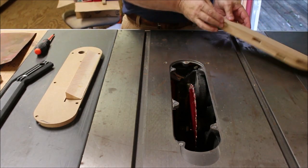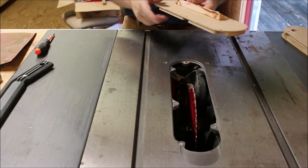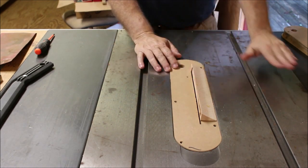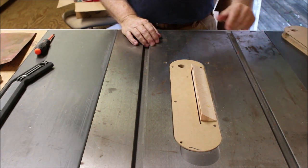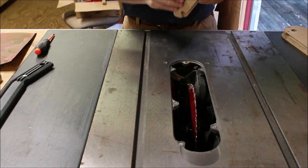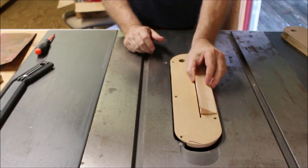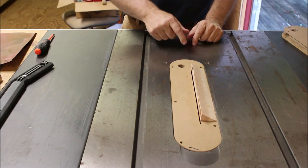One thing I wanted to make today is related to starting a bunch of segmented turning and open segmented turning. I needed something that would have the segment slide off — I've always had to stop and wait for the saw to stop spinning and remove the segment. So I made this with this little wedge of wood here, about 45 degrees I think. I just glued that on here, and here's a little clip to show you how I made that.